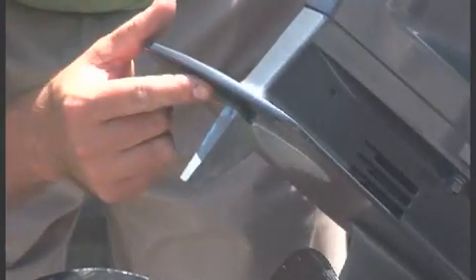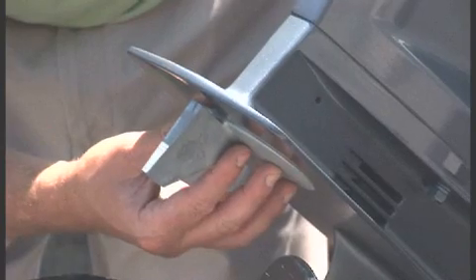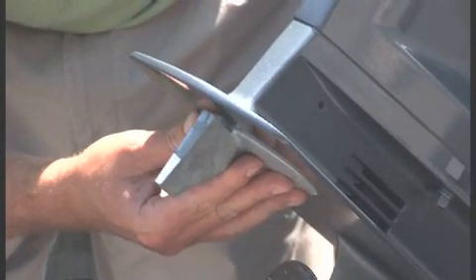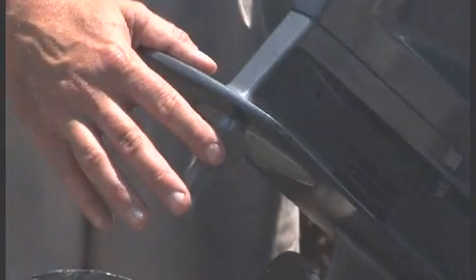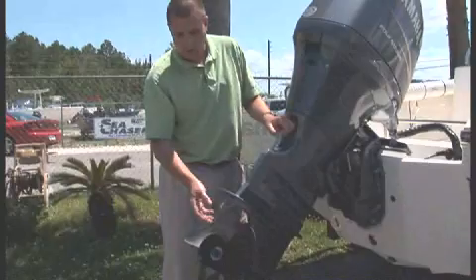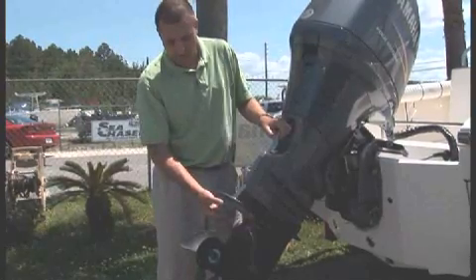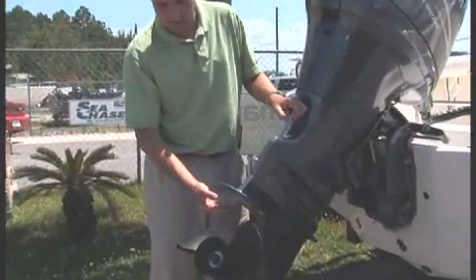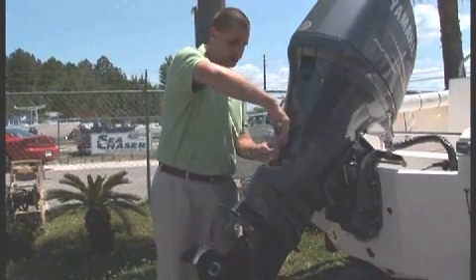On the bottom — and this is going to be a little hard to see — there are actually hatch marks from the manufacturer, kind of like a sun dial. This is zero degrees, this is one click over, two clicks, three clicks, and so on. When you're adjusting your trim tab, make sure you're only doing it in one-click increments — it doesn't take a whole lot to correct the problem. Also, if you're having trouble with it pulling to the left — say this is a counter-rotation engine or a twin engine configuration — same thing: you'll just want to bring this trim tab to the affected area.